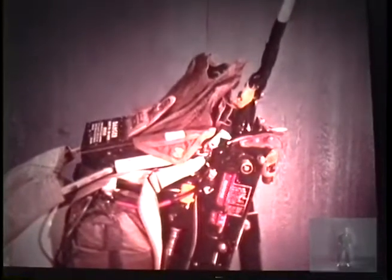Simultaneously, the scissors will be opened. Up to this point, the drogue chutes have been fastened to the top of the seat by the drogue shackle, which has been clamped in the scissors. Now, the drogue shackle is released and the drogues are free of the seat.